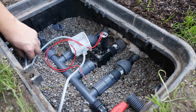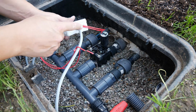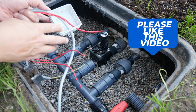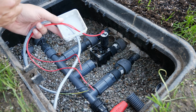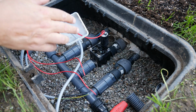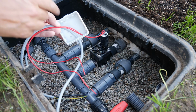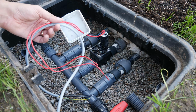I have pulled the control cable into my empty conduit. I have both cables from the outside inserted into my distribution box. This box is not waterproof. That's why I will later mount it higher up, and as soon as I have brought in the remaining cables from the other empty conduits to connect everything together, I will fill the whole thing with epoxy resin or something similar to ensure it is completely sealed.